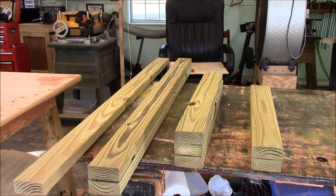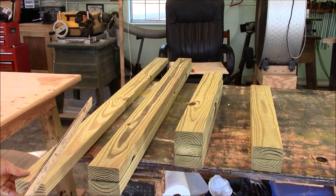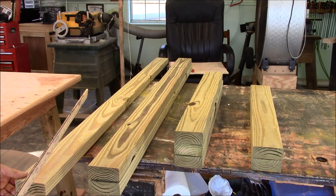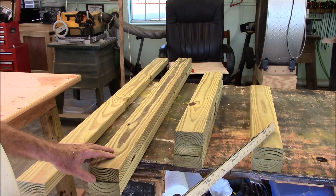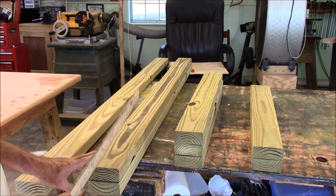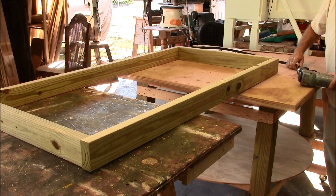To speed things along, I've cut all the wood to make the frame for the gate. They're all cut exactly to size except for the angle brace, which has to be custom fitted with great precision. To make the outer box for the frame, I'll need two 27-inch boards and two 60-inch boards. To hold everything together while I'm truing it up and assembling it, I hold it together with two-inch finish nails.